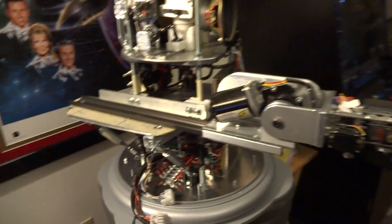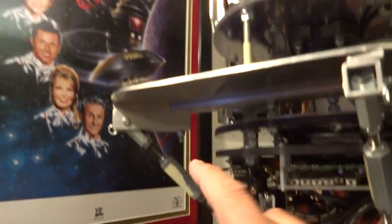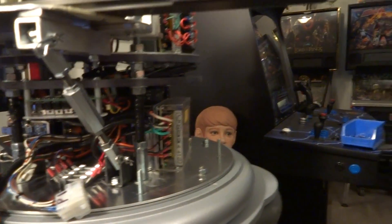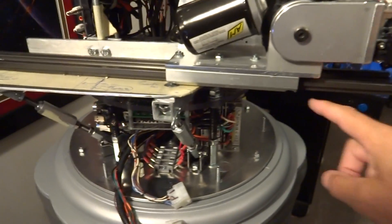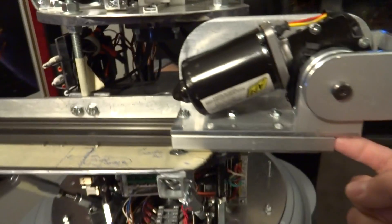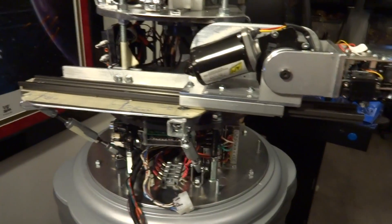This thing really doesn't move hardly at all. As I mentioned in my last video, I plan on mounting my motor down in here with the synthetic cord going through here to a pulley set of blocks, through the deck blocks that'll be cut through this rail and attached to the carriage right here. So it'll come through this way, attached here, and then the double pulley on the motor will go up through the deck, through here, and attached to the other side of the carriage. So when the motor turns one way or the other, it'll either pull it this way or that way.